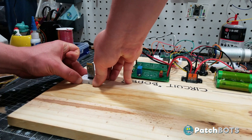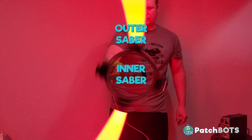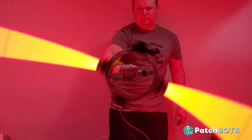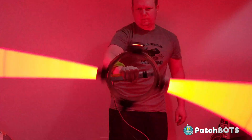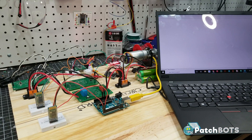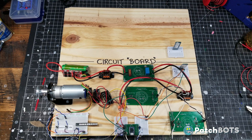The absolute last thing we need to do here is set up our connection to the outside of the saber. The inner saber and the outer saber are two completely different circuits — they can't be wired together since the outside will be spinning around so fast, but they still need to be able to communicate. So we will be using these HC-05 Bluetooth modules to send some data back and forth. This laptop here is hooked up to the outer saber side and is receiving data from the inner saber, which means we are officially done with the inner circuit.